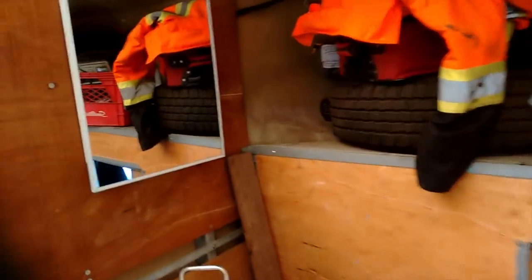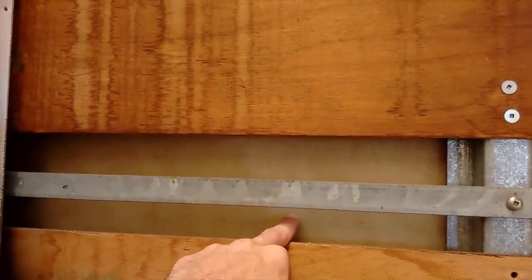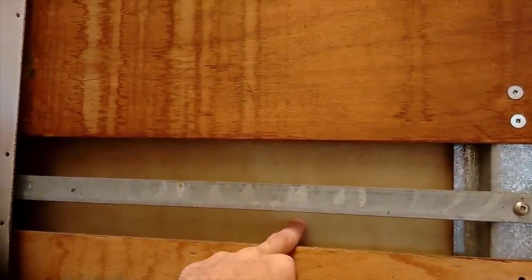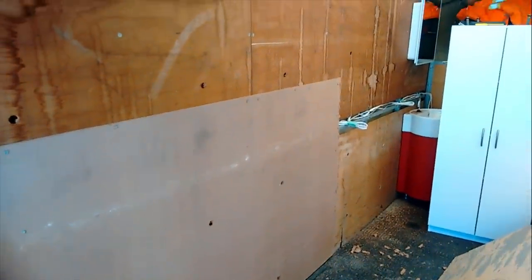Right now there's some Luan already in here, so I'm going to drill some holes and spray foam on the inside. It's going to work out pretty good, I hope. I've got about an inch and a half in the wall. I'm going to run my wires through first, spray foam in there, get a little R-value with the one-inch foam board, and hopefully be warm. I put a thin little wafer board over an area of the Luan because I had a ton of holes that I didn't want the spray foam to pop out of.